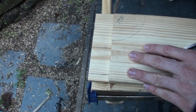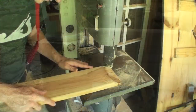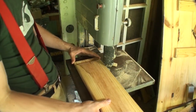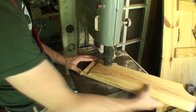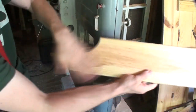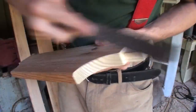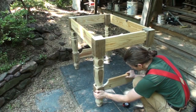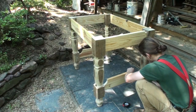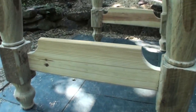These pieces are going to have an offset tenon towards the bottom and then a radius cutout — you can see how it goes together. I use a band saw to cut out those pieces. It's pretty much doing the same thing as the upper aprons; it just has that little radius cutout, which gives the lower shelf an elevated appearance and adds a little style so it's not too square and boring. I also used a rasp to take off the hard edge off that radius cut from the band saw.